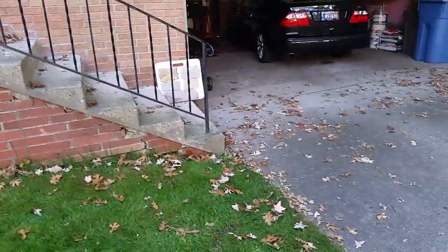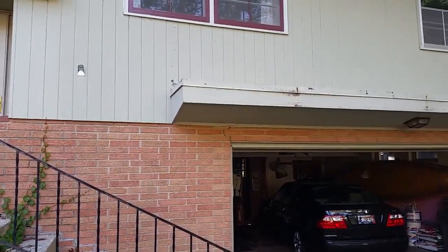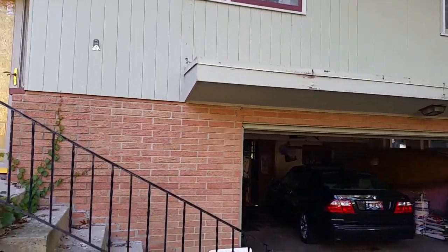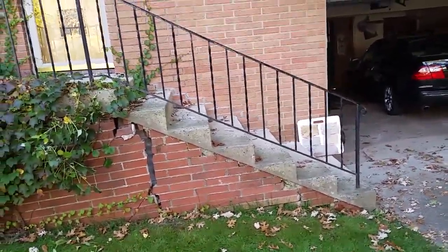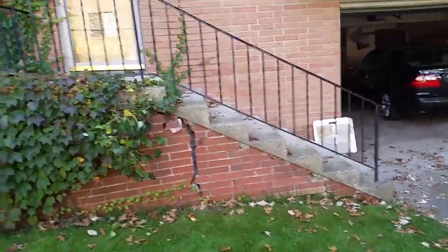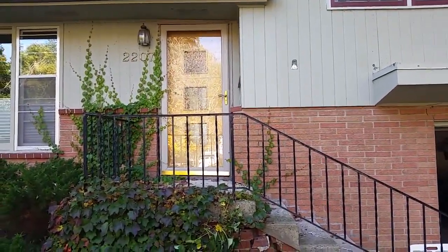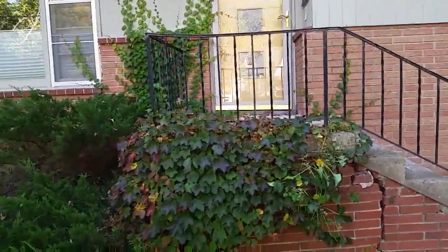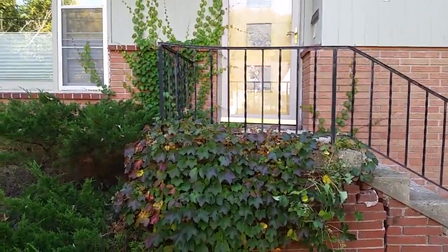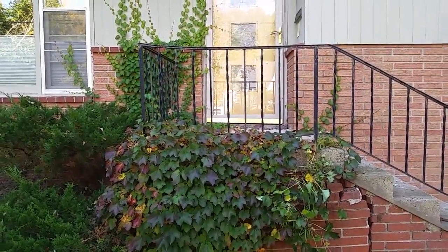then put a 12-inch landing in there because they've got this overhead thing right here that they keep, it's easy to run into. If we shorten them up a little bit, we should have less of a problem. He wants to eventually move this door over 1 foot to the left, so we're making this 1 foot wider to the left than what it currently is, to accommodate for that.